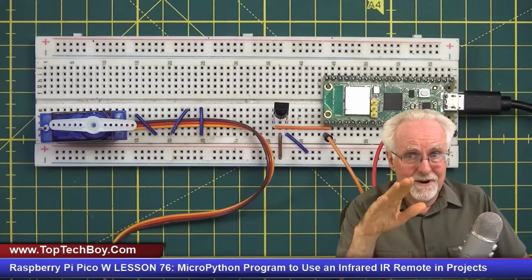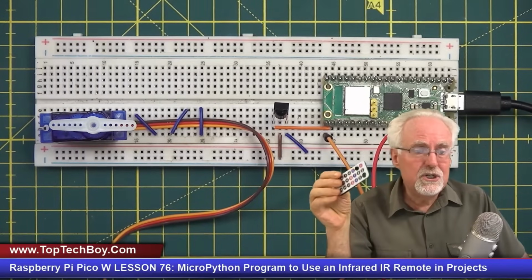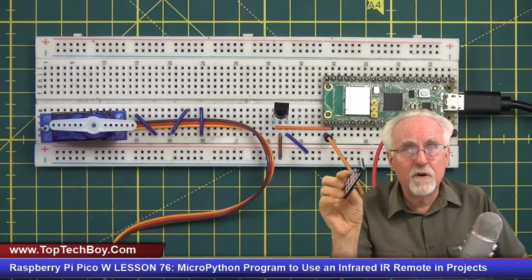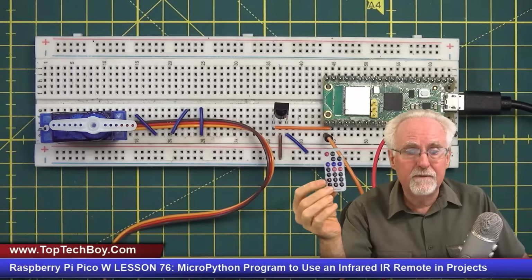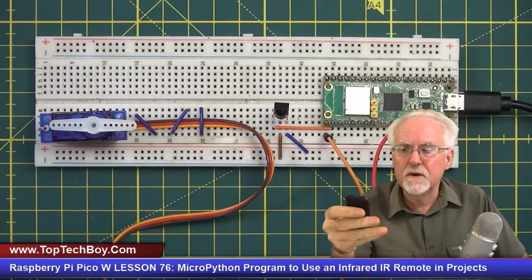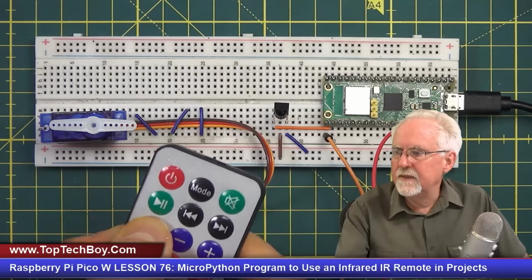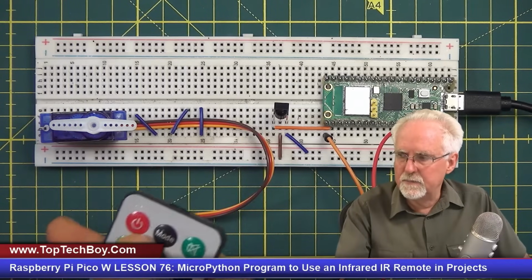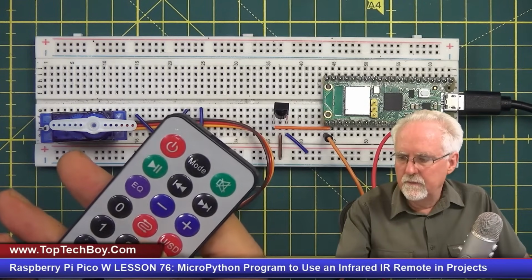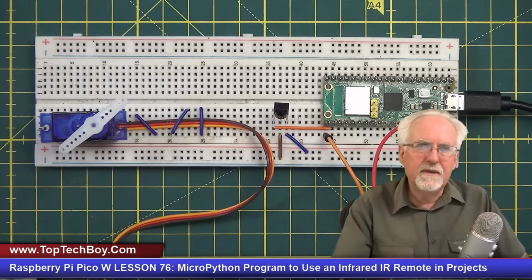Okay, guys, I am really hoping that this next homework assignment will be pretty easy, because I've done the hard part here, which is generating the command. Now that you can generate the command, I want you to go do something useful with the new command. As a demonstration, we are controlling this servo. Notice if I just do a bunch of nonsense and then say equal, nothing happens. But I can say power and then 45 and equals, and there it is at 45 degrees.